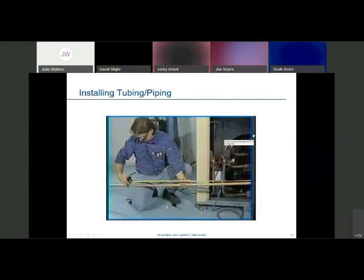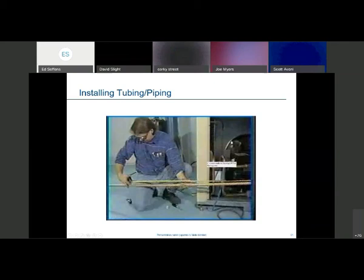We're going to look at line sizing — both the liquid line and the suction line. We're not taking into consideration the discharge line or the liquid drop leg from the condenser to the receiver; those charts are available. We're looking at line sets from the condensing unit over to the evaporators. I'm using the Heatcraft Engineering Manual, dated April 2008 — you can download it as a PDF from the Heatcraft website. It's a good useful tool for designing and laying out systems.